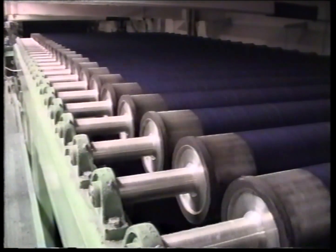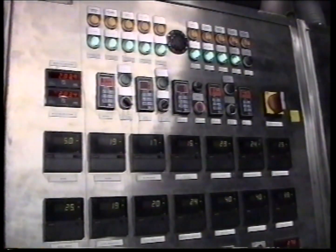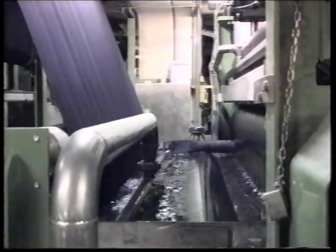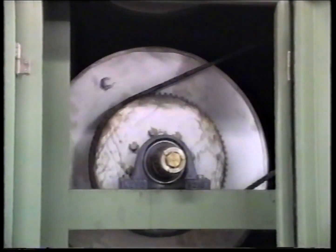The center of the yarn remains white. After the dyeing is completed, the sheet of yarn is rinsed to remove the non-fixed indigo and then strengthened. This means that the yarn is coated with a thin layer of starch that gives the yarn enough elasticity in order to ensure sufficient processing during the weaving operation.